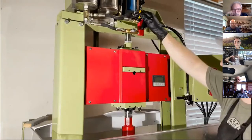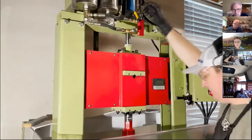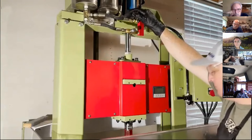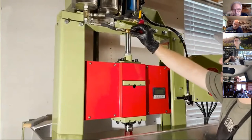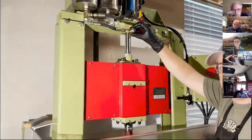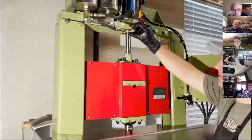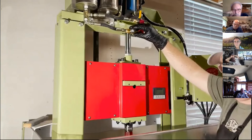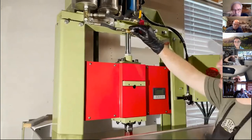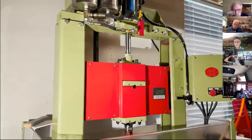We have a rapid feed tap valve. That's simply for lowering it down to get close to the rock. And then the micro feed, it's a needle valve. The needle valve just goes a lot slower. This is the main function. The further you wind it, the faster it penetrates. And that's about that. Over here is our master switch.